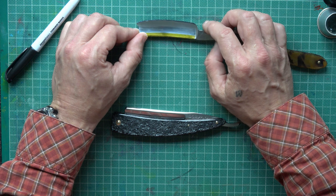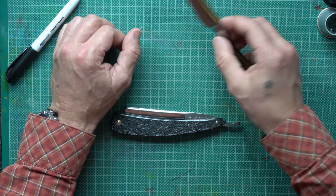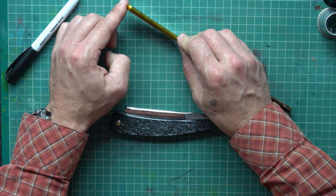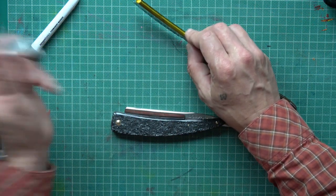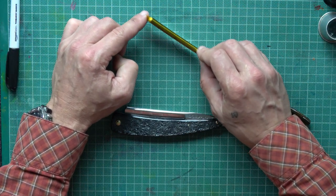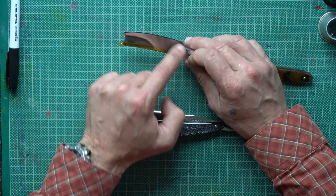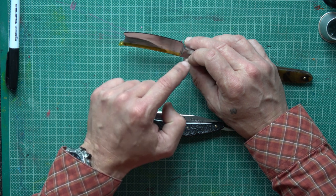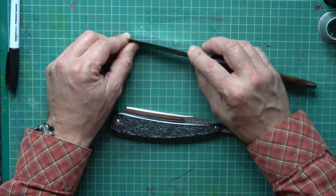It really was. Even on the 320 grit, I was just like, man, this is going to take forever. So what I did is I bread knifed just the heel, very, very gently, checking a lot of the time. I could have been checking it with this, but I was doing it under the scope just because it's quicker. The bread knifing was basically nearly hitting where my bevel was heading towards, and it seems to have helped it along a lot.